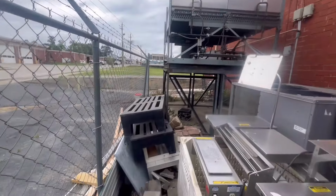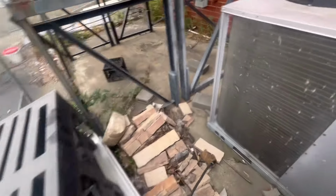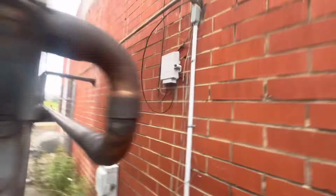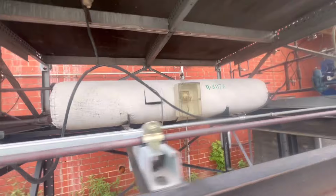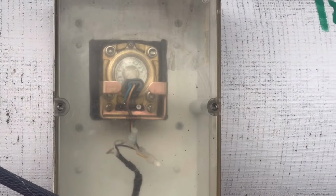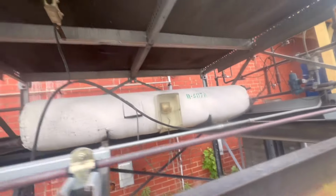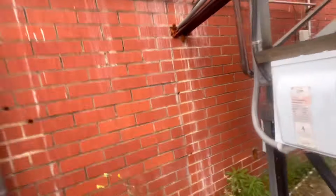Anyway, guys, this is the condenser. Got a hot mess. Getting to it could be a pain. Look, they cleared it up compared to what they did before. Very simple setup. We're at about 40%. 407A. Same, looks like it could use a cleaner. But anyway, I'm finna just leak check the store, them two pits and the rack, just to verify that we don't have any leaks.